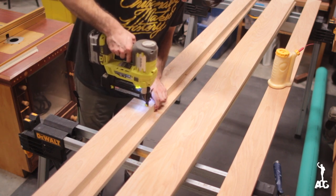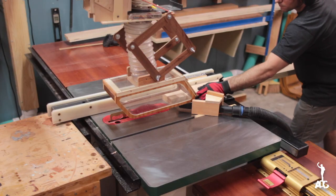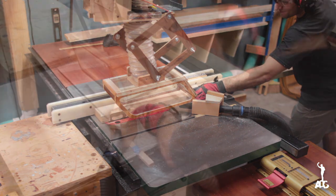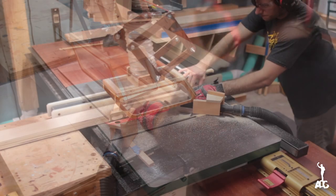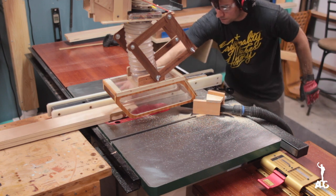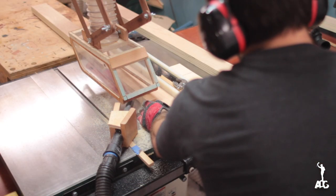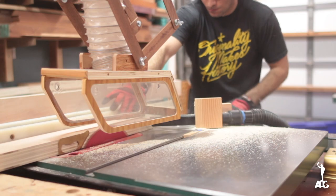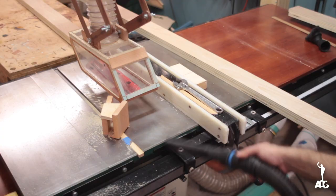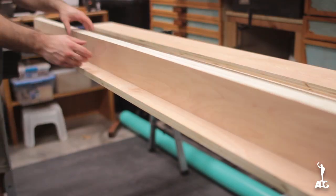So this middle part in my design has about 3.5 inches. It could be a little bit taller. Then I go back to the table saw and I trim so that the sides are flush. As you can see, my dust collection isn't working for such trimming jobs, and I think I'm going to redesign another shroud to have just for those particular cuts.